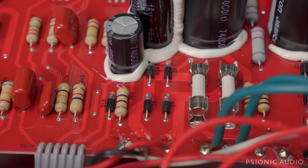I got it mostly back together and powered it up, and the pots all work now. But hear that buzz? It's on the clean channel, it's affected by the master volume, and it's not affected by the preamp volume. And it gets worse if I pull V1. But if I tap on the rightmost power tube, that tube is very, very bad — and I think that's what pretty much directly causes that buzz.